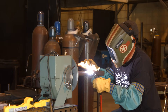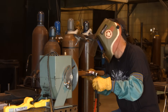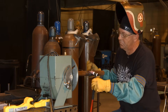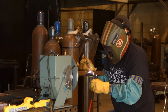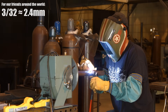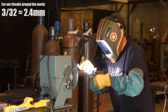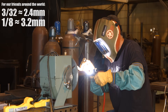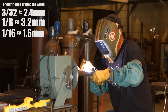I did a little dash and dab on bottom when I was coming off the bottom — I might be slightly low — and then when I got up here and I was comfortable I walked the cup. For the fill, I could do a 3/32 root, a light 3/32 fill so I don't remelt my root pass, possibly run an eighth inch fill and bring it up to flush, then go back to a 3/32 or even a 1/16th for a cap.